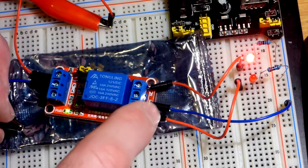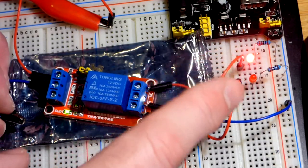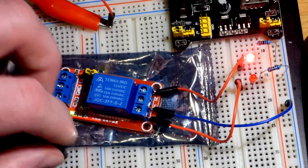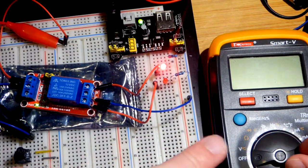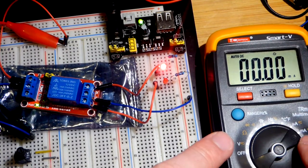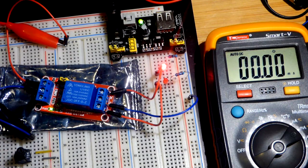Or you could just wire these two up for the normally open switch, or you can wire both of them up if you want — you don't have to use both. This one is labeled pretty clearly. Let's look at current. I'm going to set the meter to measure milliamps. I already set the power supply so that it would only output about 500 milliamps of current.